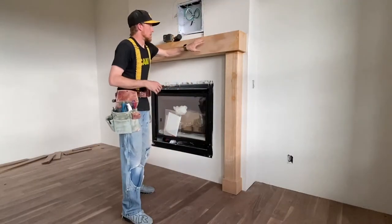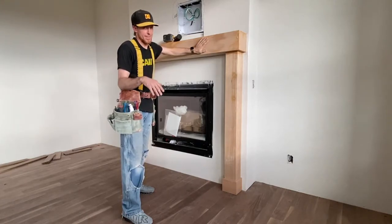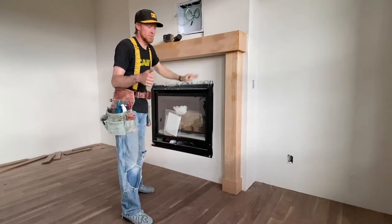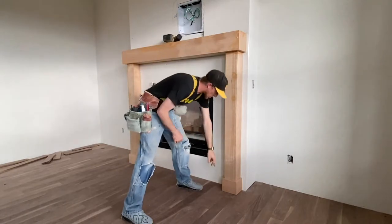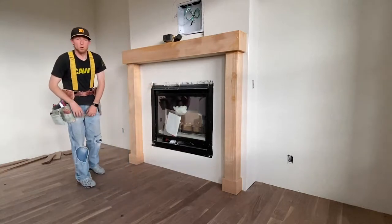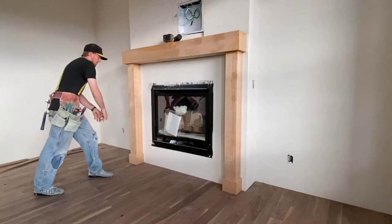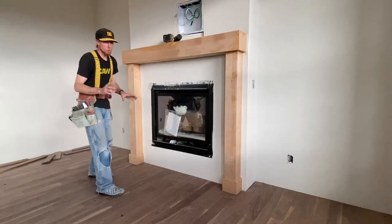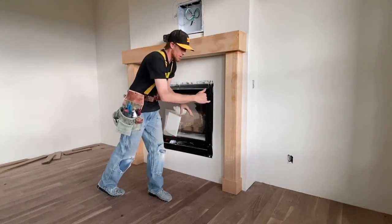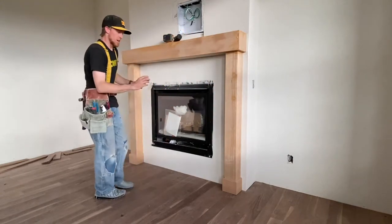We're back. Putty's dry. And guys, sorry, while the putty was drying, I was charging the phone, shoot more video, and during that time, I put on two, we call them boots, mantle boots, but they're two pieces on the bottom, just kind of finishes the bottom wrap a little bit. Real easy, three pieces, miter on a 45, 1x6, just went around to kind of complete it.